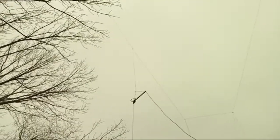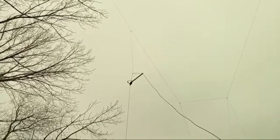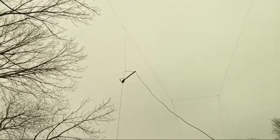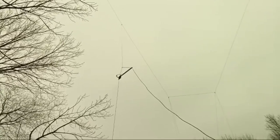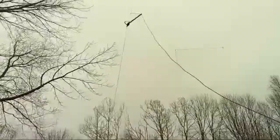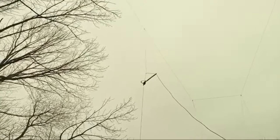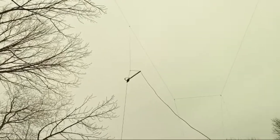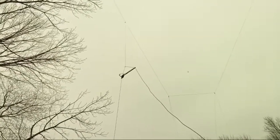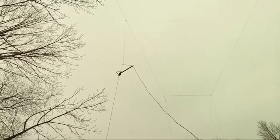It's exactly 23 feet per leg, fed with RG8X direct, and I put a choke in there. Ed's in the chat — hey, what's going on? I'm outside jerking around and made a little tee fitting for the vertical dipole at the feed point.